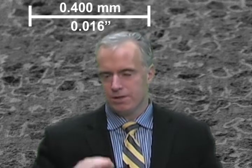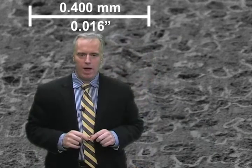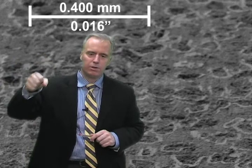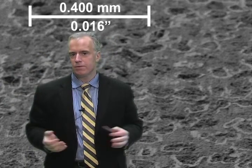The purpose of sticking the wheel is to clear away the resin bond right in the proximity of the surface and give space for chip formation. After you true the wheel, the resin bond is sitting very, very high, and we've got to clear away just a little bit of that resin bond to give space for those tungsten carbide chips to come out during grinding.